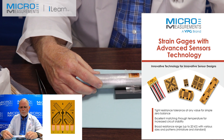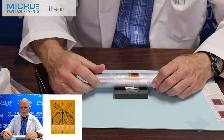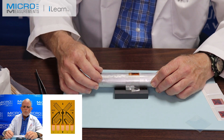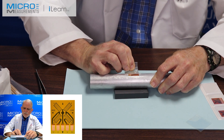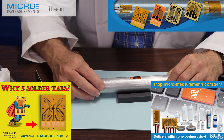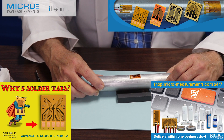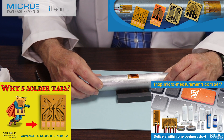We have waited our full two minutes of cure time under the tape. We now need to remove the gauge handling tape — lift it at a shallow angle to avoid damaging the strain gauge. Because we don't want to damage the bond line, we want to put the adhesive in shear as opposed to peel. So I'm going to take the tape and pull it 180 degrees back on itself, exposing the bonded gauge. Having finished the bonding, I'm going to do a quick visual inspection — looking for a uniform color underneath the grid indicating a uniform bond line thickness, and any lumps, bumps, or perturbations in the strain gauge. It looks pretty good.